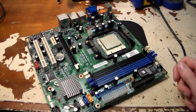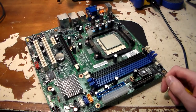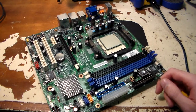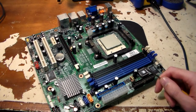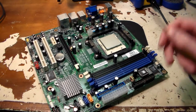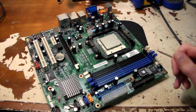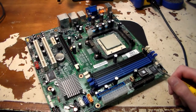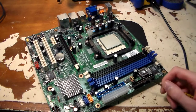I did have a little bit of trouble with it. I believe this motherboard is using lead-free solder, which has a higher melting temperature and doesn't mix really well with leaded solder like I was using, so I definitely had some issues there. But it wasn't too bad. The hardest part was when you remove the capacitor — getting the vias cleared out so you could actually put the new part in. That's probably the most difficult part, but it took just a little bit of extra time and wasn't bad overall.